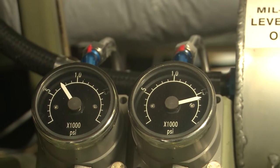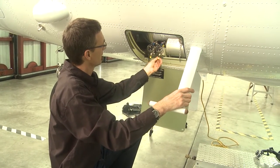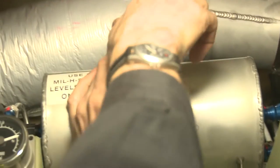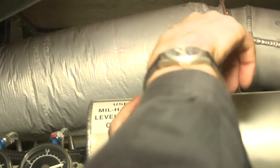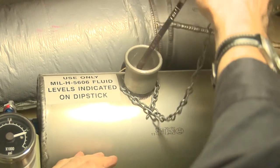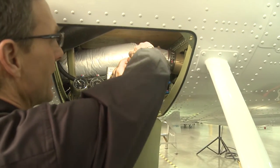and a hydraulic filter located in the middle of the power pack assembly. These filler valve assemblies are typically used to add nitrogen pressure. The accumulators are charged to 750 psi. When checking the reservoir, you unscrew the cap and measure the level of the fluid on the hydraulic stick, and when you tighten the cap it actually expands a plug in the filler neck.